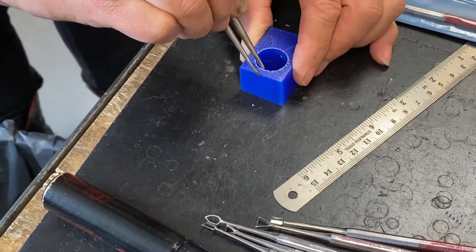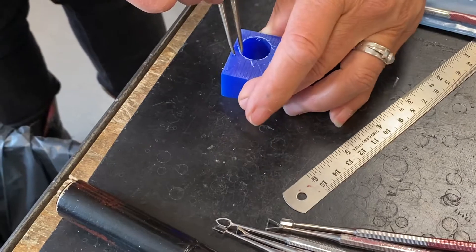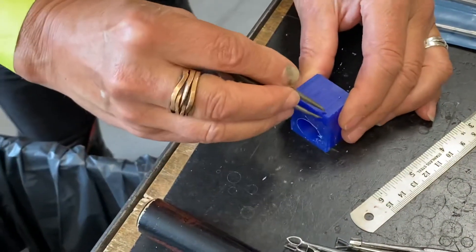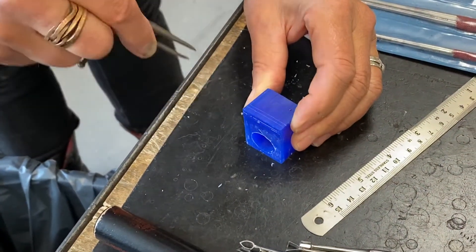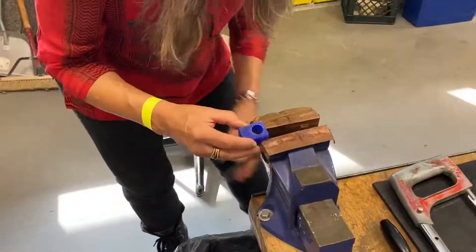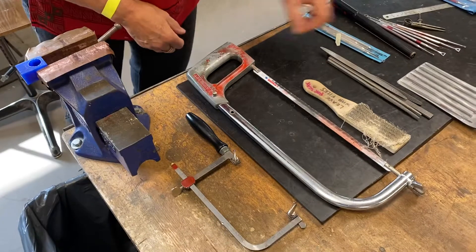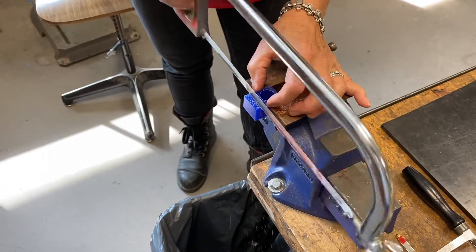I can take this and drag it around to get a pattern to work off of. I'm going to be a little shy on the sides — that's okay. Usually these are used for drawing lines if you want to put lines down to know where you're working. But what this has done for me is show me where I need to cut this off. So I'm going to move around — which is what I love about doing metal work, that I'm not just sitting in one place — and I'm going to put it in the vise. I'm going to use this hacksaw, but I could use the spiral blades, working from the top and leaving a little bit of extra material.